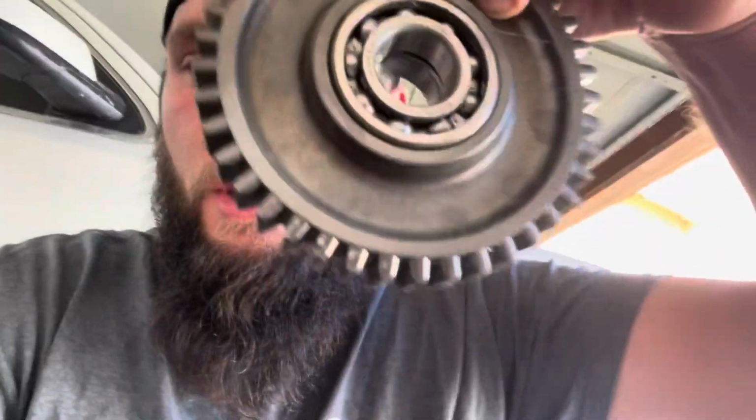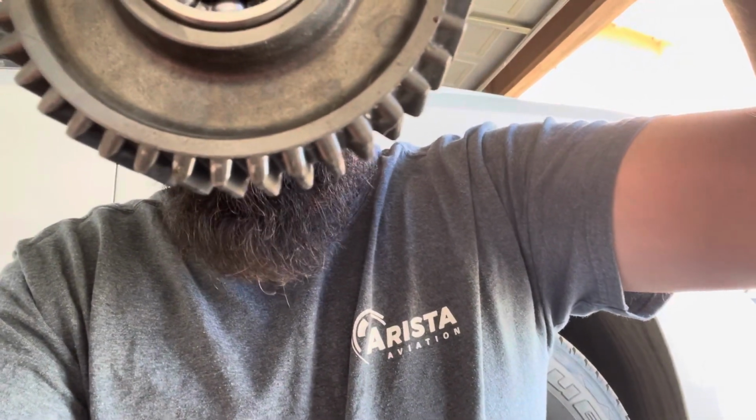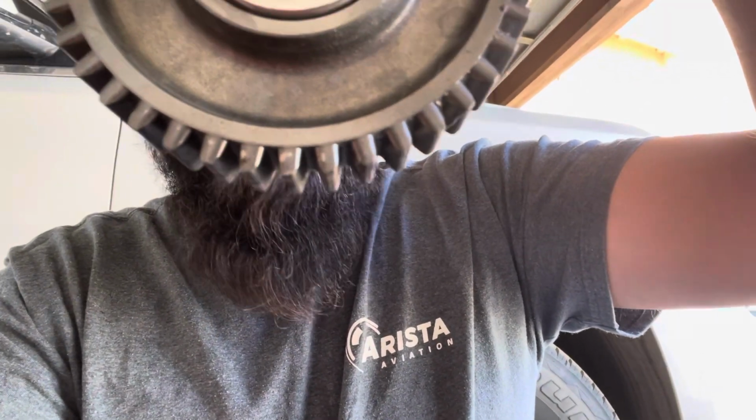Now I've examined the tractor. You can read in the forums; they tell you it don't matter, but I examined the tractor to make sure that this is the upper gear. So the PTO would be right under it, about where my beard is. PTO shaft splines there and comes out the front of this housing. And then this mates to the PTO shaft for the rear up top. There are no bearings near it. There's nothing around it. It should assemble in there without any of that installed, without any ill effect.